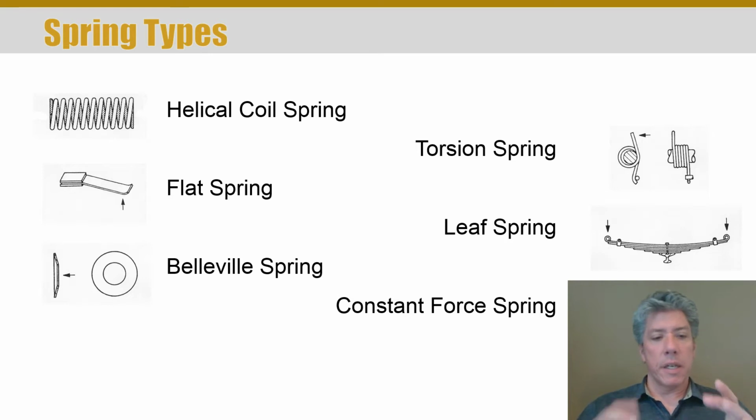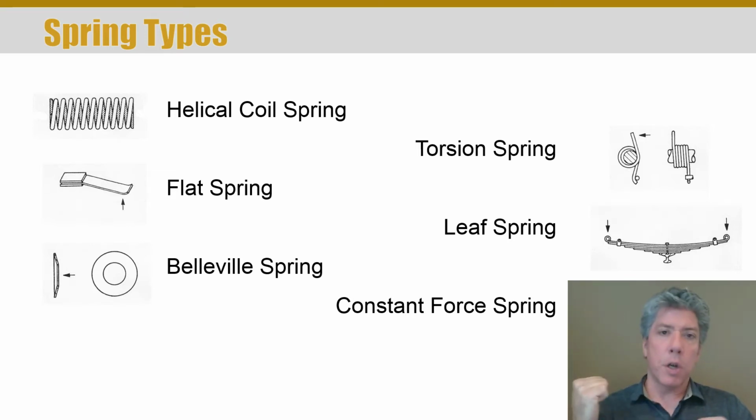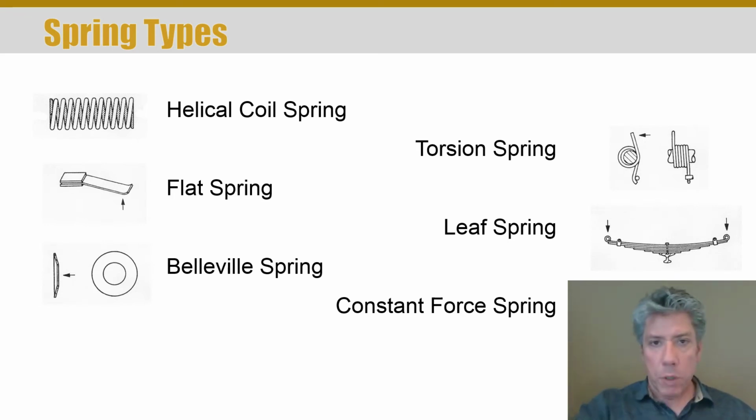Turns out there's actually a sort of a four-pointed connection point on the end of each spring, and you can put a long lever in this connection point and turn the spring, tensioning it. And of course you've got to move one bar down, then get the next bar in the next position, move it down, and so forth. I mean, if the thing lets go and you hit yourself in the head, it could kill you. It can be quite dangerous. But I'm still alive. I didn't get hurt by it. I was very careful and installed my own torsion springs.